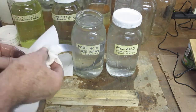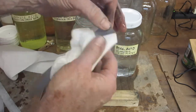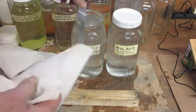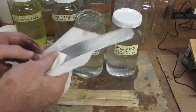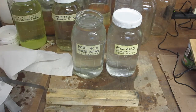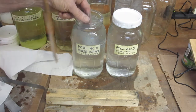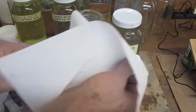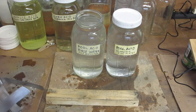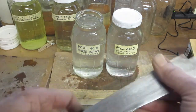They're ready for another GANS run. This way you can reuse these things. I know they're cheap and easy to make, but I like to get as much use out of them as I can — there's no reason to waste material. You can keep using them until they're pretty well consumed, a lot more consumed than this. So that's the cleaning procedure I do for the zinc electrodes for making either CO2 GANS or zinc oxide GANS.